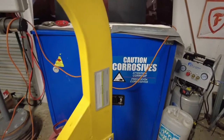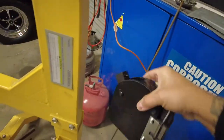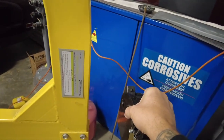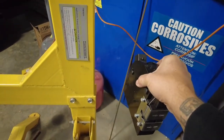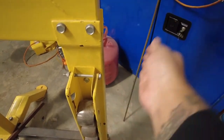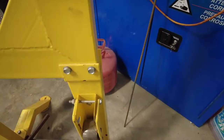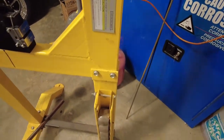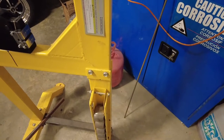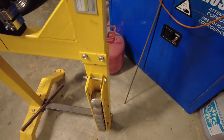What I want to do is have them off the side, so the shrinker here and the stretcher just on the other side, and then I need to have them stand off and staggered so the control rod from the back doesn't interfere with each other. What I'm thinking is running a piece of square tube at a really sharp angle, like 70 degrees or something off here, and then make a little platform there. This thing is plenty sturdy to handle my foot pressure pushing down on it. The angle I need is too steep for the bandsaw, so we're going to cut it by hand.